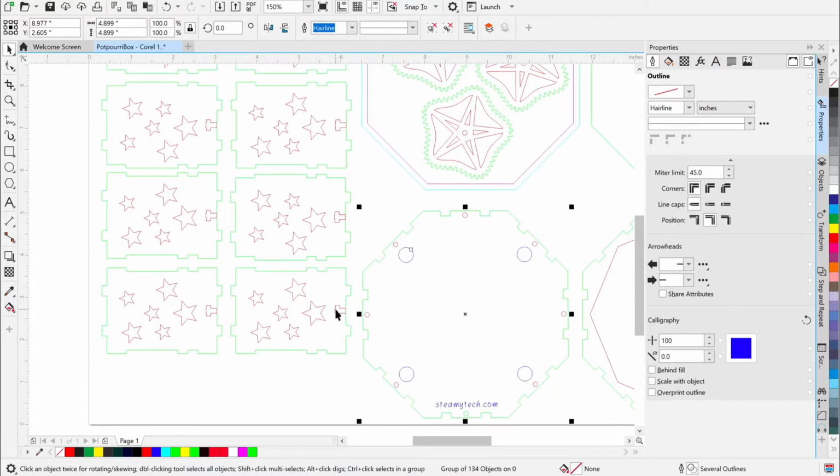Now I did it that way rather than putting the holes going into the bottom, because I wanted to make sure that if I put feet on the bottom, I had lots of clearance and I wasn't going to scratch a table with the side of a nut. Be a little careful when you build these to think about those kinds of details. So this design is using the screws going up from the bottom into the sides of the box. If you're worried about what the side looks like, you could swap those around, but then you've got to be careful with how you mount them.